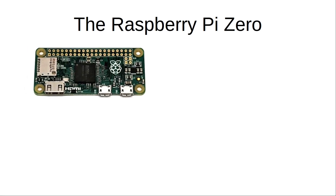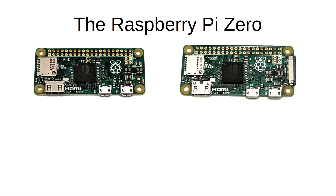I'm going to show three different models of the Raspberry Pi Zero. These are almost identical in size and the positions of the connectors — this is deliberate to allow you to use them as a direct drop-in replacement. First is the original Raspberry Pi Zero, which was a game changer in terms of pricing for a single board computer, though it does not include wireless or a camera connector. The Raspberry Pi Zero W came next, which added wireless networking and a camera connector.